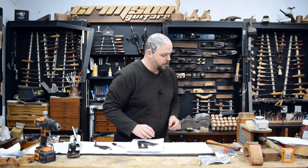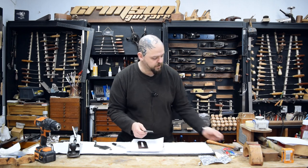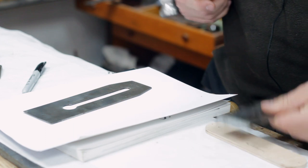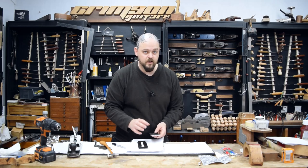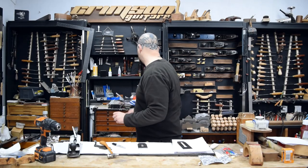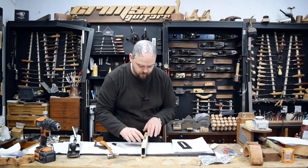So very quickly — in this case I think it doesn't actually need a hammer of any sort. I have been known to get a large chunk of wood and very carefully peen over the edge until it is fairly accurate. In the worst of cases you will have to do that. It's malleable iron, it's not too hard, and that will work quite nicely. But in this case I'm quite lucky in that it's relatively flat — it's just not quite perfect.